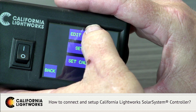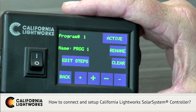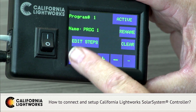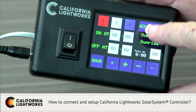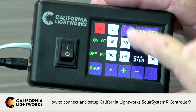You also have fully automatic mode, accessed through setup and then edit programs. You can have up to ten programs in a day — the steps go one through ten. You can rename each step: propagation, early veg, veg, pre-flower, and different settings for each step. Save each one and all those programs are stored in memory. Through editing steps you can set the spectrum in each step for exactly what you want, rename it, and then adjust the light level of each spectrum in each step.